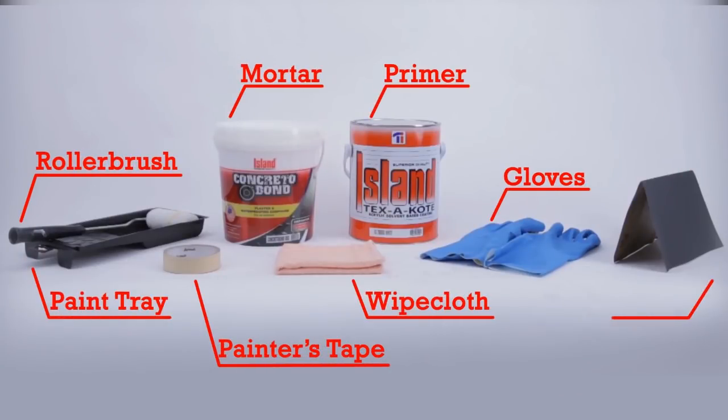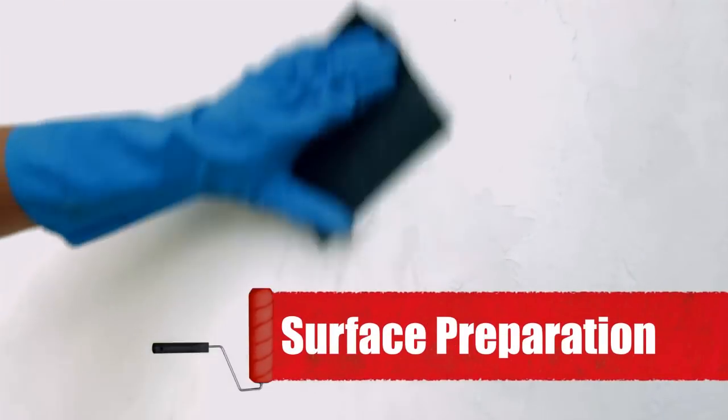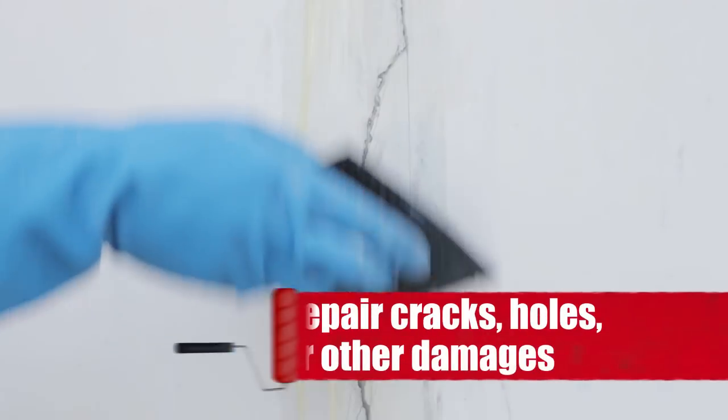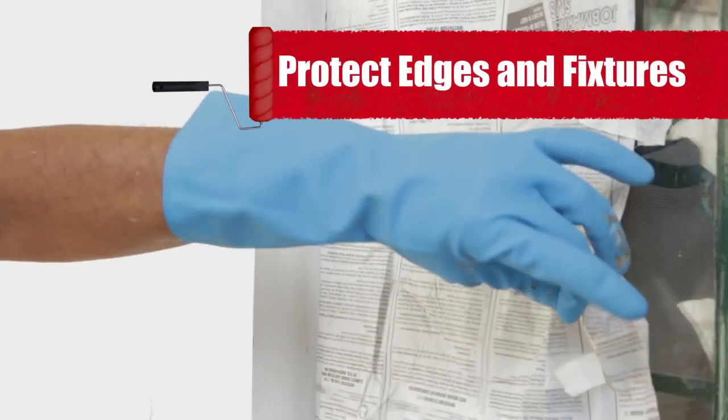Here's what you'll need. The first step is surface preparation. Start by making sure your painting surface is clean and free from dust and debris. This gives your primer and paint a good surface to bond with. Use your wipe cloths to clear dust and loose debris. Check for damaged surfaces and fill small cracks and holes with a crack filler if needed. To make it easier to clean up afterwards, cover window edges using painter's tape.